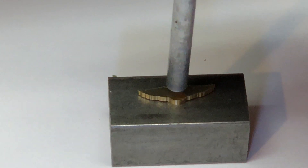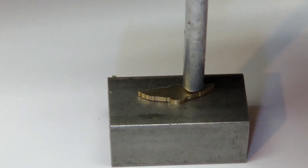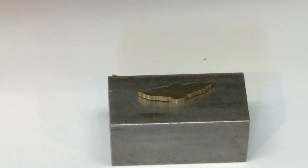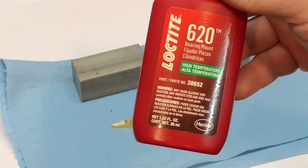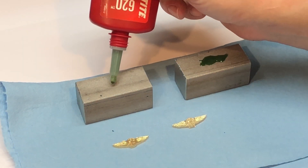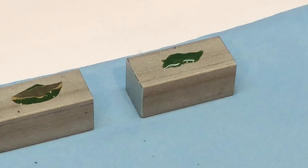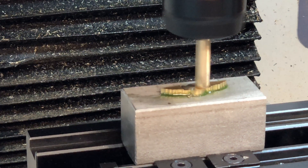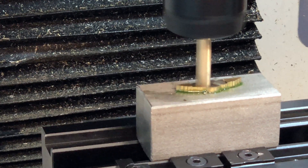Normally we do this operation with a fly cutter, but my strategy is to use a quarter-inch end mill cutter and slowly work it around the part, never letting the cutter get off the edge of the part — this way hopefully I don't pick up an edge and send the wings sailing across the mill. I'm going to use Loctite 620: one, because I need something that will fill the gaps, and two, because of the heat resistance properties. I gotta tell you, I'm not really sure how this is going to work out — if they do go sailing off, I hope they land next to the screw I'm missing.